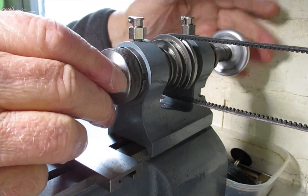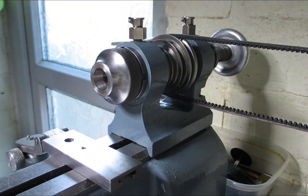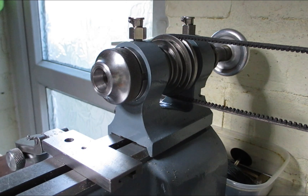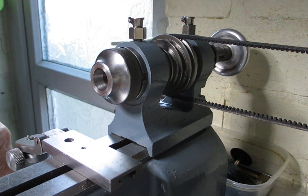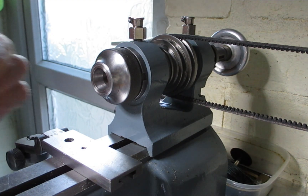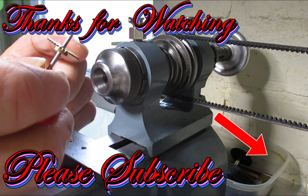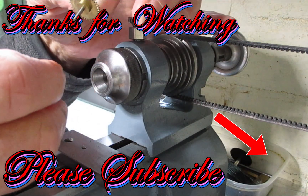I hope that's helpful. You don't need to do too much for torsion clocks because they don't wear, so you don't need to file the pivots and then burnish them. Yes, if you have to replace a pivot then that's something you will have to do, but just purely for polishing the pivots that's all you do — that's all I do to it anyway. I don't seem to have any problems.